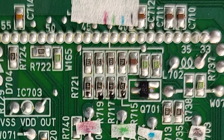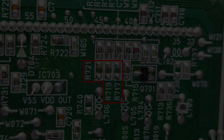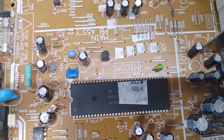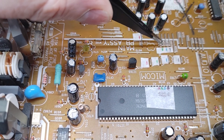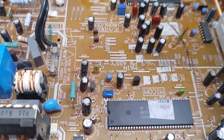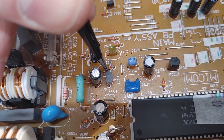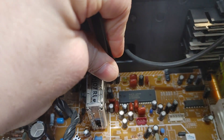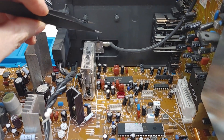First thing you need to locate is directly below the Micon chip. On the bottom of the board is this cluster of OSD factory grounding resistors — remove them. Back on the top of the board, here is a quick rundown. Here's the Micon; you can see the signal blanking and the RGB pins. They run through these jumpers, and these jumpers here are where you're going to inject RGB. These caps are going to be replaced with 0.1 microfarad ceramics. The IC771 output pin is where you're going to pull 5 volts for your blanking switch. Moving to the back of the board, we have an unpopulated header port. This is where you're going to pull ground for your termination resistors. We're going to put the BNC connectors right here on the back of this panel.